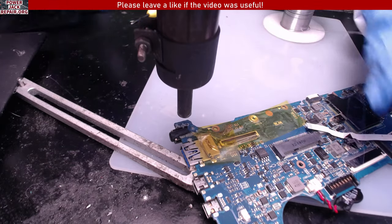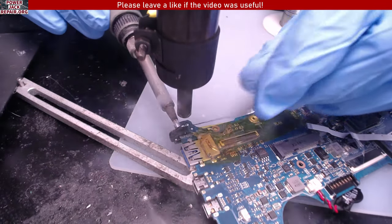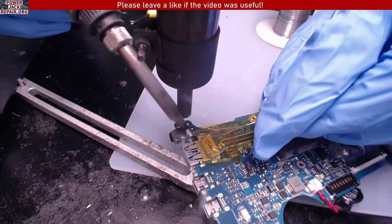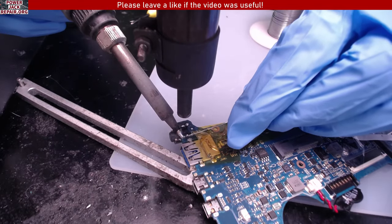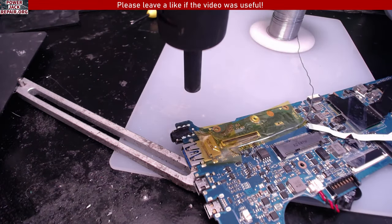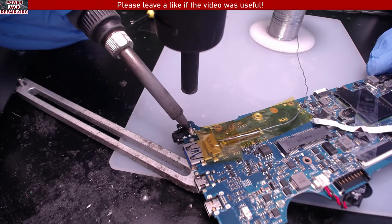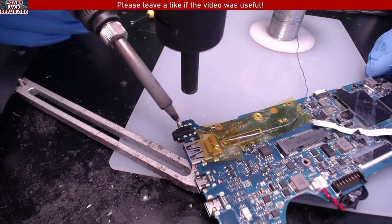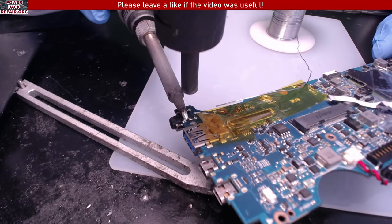This is a leaded-base solder. We add it to the unleaded-base solder that's on the motherboard. We add a whole bunch of solder right here — make sure it all penetrates in. Then what you do next is add just a little bit of hot air. It's going to melt the jack's plastic housing slightly, but at the same time it warms up the motherboard and lets the solder penetrate into the joints. Think of solder just like a lubricant — it will help you get the connector off the motherboard really easily.